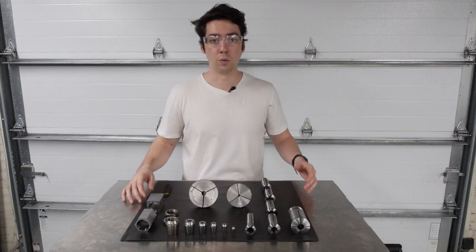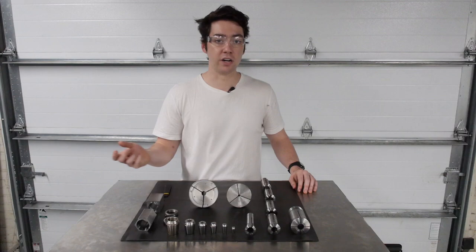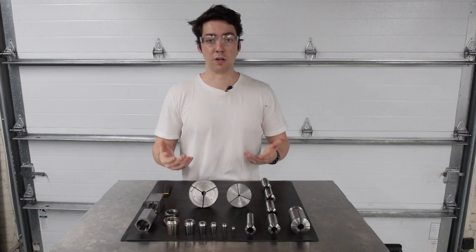One of those benefits is a much more repeatable clamp. So let's say I was using a 5C collet working the lathe — I'd be able to take my part in and out every time without risking the repeatability of that clamp. It would be pretty much the exact same amount of runout every single time, which is a big difference from a three-jaw chuck, because if you were to take it out of a chuck and put it back in, you can be pretty certain those jaws are not going to be concentric with each other.